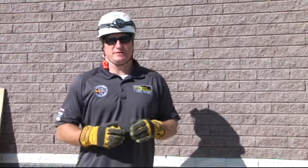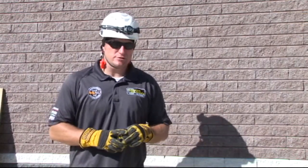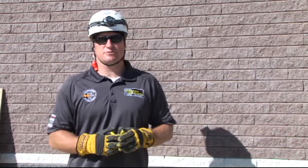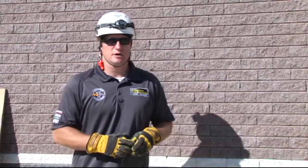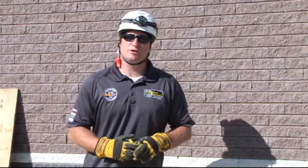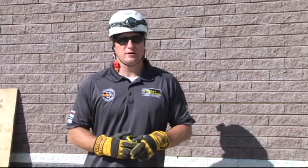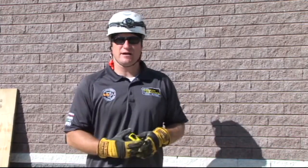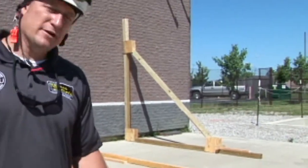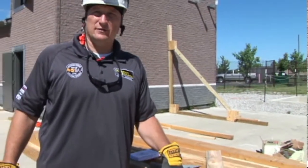This segment is about the construction of solid sole rakers. Typically, we're going to build them as either 45-degree solid sole rakers or 60-degree solid sole rakers. If we're building on soil and not a surface like concrete or asphalt, typically we're going to choose the 60-degree rake because it has maximal height with minimal horizontal force application. For today's application, we're going to do a solid sole 45-degree raker and also discuss the variables for the 60-degree raker.